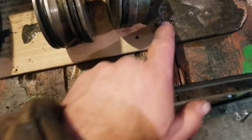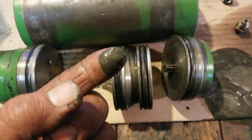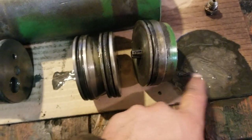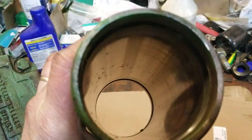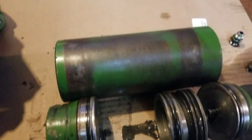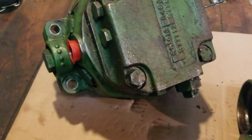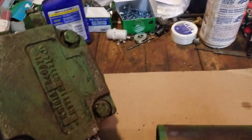In fact, this one - I found all this crap in there. It looked like metal shavings, and it really is metal shavings and oil - it's really gross looking. But the bore of this thing is pretty smooth. So that's the hydraulic accumulator for the power brakes on a 4320. Now I'm going to pop this pump apart and keep track of the parts.